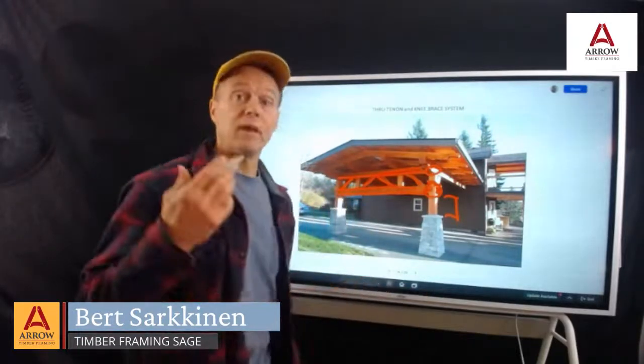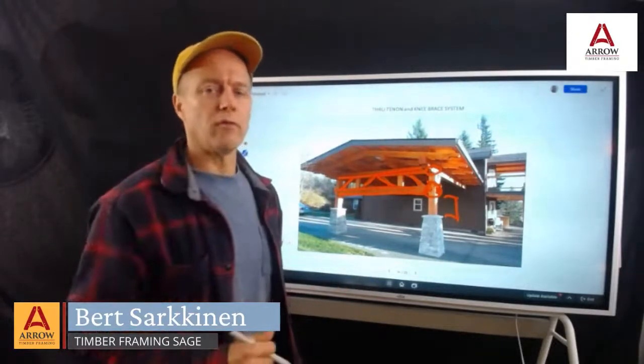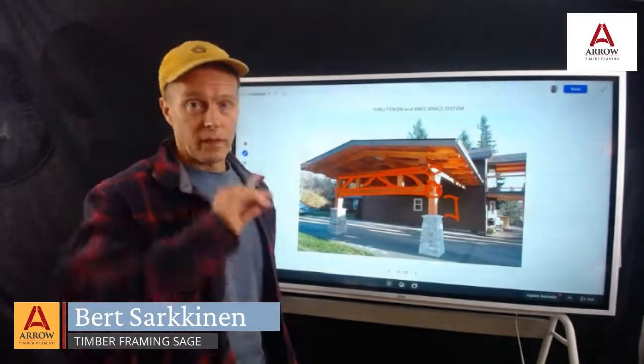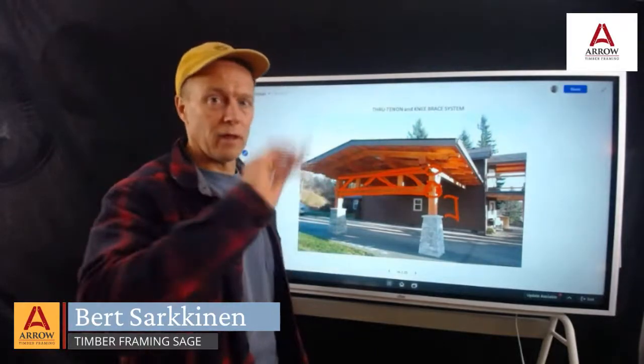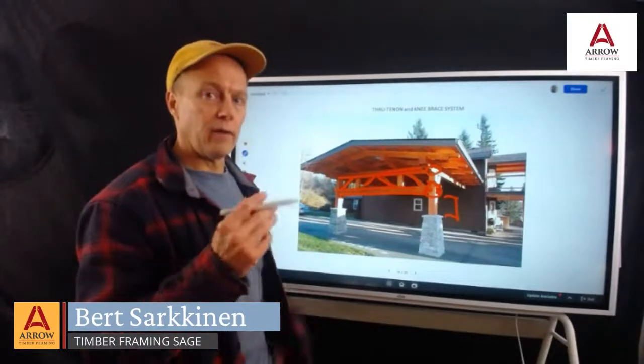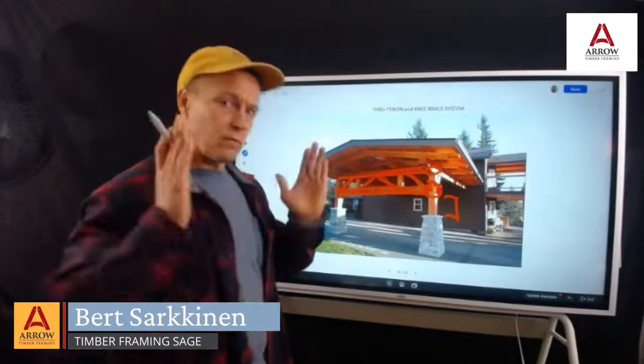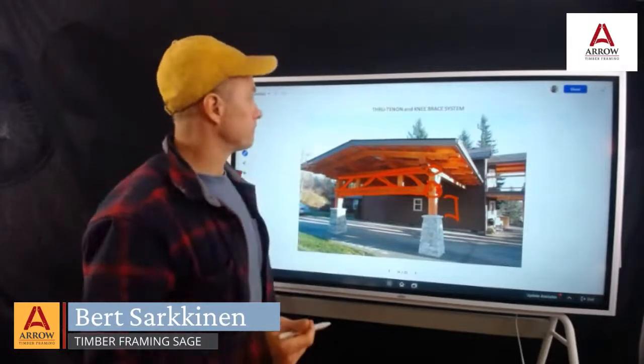That's one of the advantages of a through tenon. And you'll see that in many old timber frame buildings. That through tenon, so then the post goes through, there's plenty of relish with that tenon going through, and then maximizing that perpendicular to grain tension resistance.